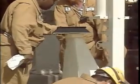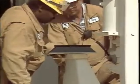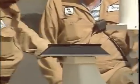By using a machinist level and the jack bolts, level the base plate according to the pump manufacturer's specifications.